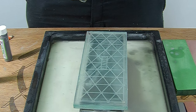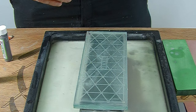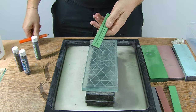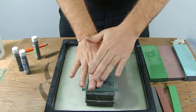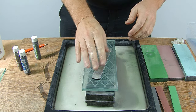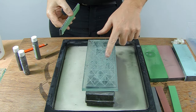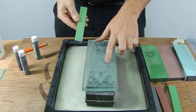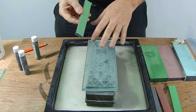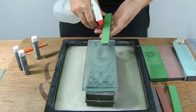And then coarse powder — just a little bit of crispness on there. 400. You can hear how aggressive it is. That's what you want on your coarse grit stone. The advantage of having those grooves is that it allows the abrasive to catch and become more aggressive. It also clears off all the residue and channels it out in the liquid, so you're able to cut more efficiently and faster than with just flat glass alone. That's the real advantage of these.